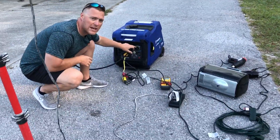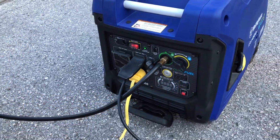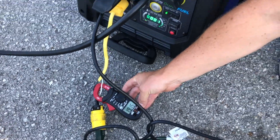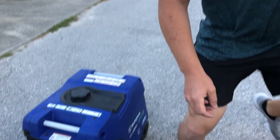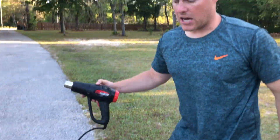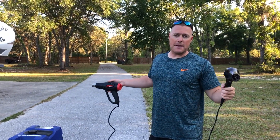As you can see, we are right now running on propane. So I'll turn the propane on and we'll fire up the generator. We jump up to almost 20 amps. Come over here and let's listen to the hair dryer — it's perfect and smooth, what you would hear inside the house. So now what I'm going to do is engage the other receptacle, which is going to be a heat gun. So this heat gun and this heat lamp, which is right behind me — this floodlight — that total draws 20 amps as well.